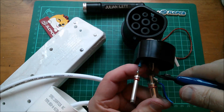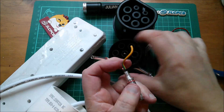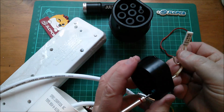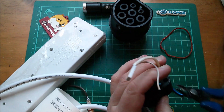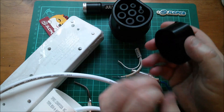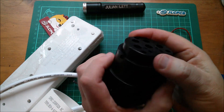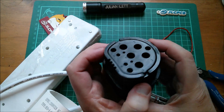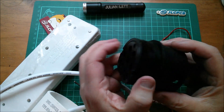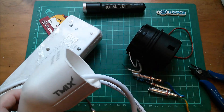That connects PP — proximity pilot — through that resistor, through the thermal cutout, to earth, or what they call PE: protective earth. On the basis that I might reuse that thermal cutout, I'll cut close to the connector. So that's the earth pin, that's the thermal cutout. I'll cut this resistor because I'm not reusing it, and that's the shell which screws in and slides in to hold all the pins.